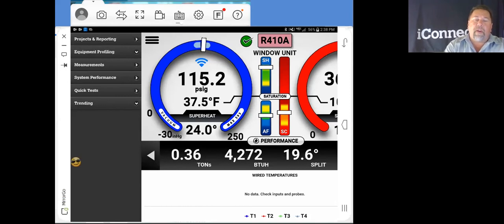The thing is, with the long range probes, if you have a standard range system and you have an iConnect, the combination of probes that you can use is to get a 911M, which is the temperature humidity probe. You can get that in the long range, and a repeater. So inside, you're going to substitute one of your supply return probes with the new long range, and then have the repeater for the outdoor use. That way you'll have a long range probe on the inside of the structure and one on the outside. That will give you long range capability. So it's not just a point of buying two of the 912Ms. I understand a lot of these guys bought a 911M because then they can use that other 911M on the outside to get their outdoor ambient air temperature, with wet bulb or relative humidity outside as well. So that's a good way to do it.